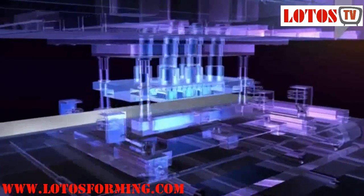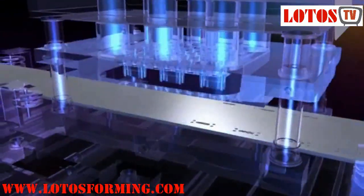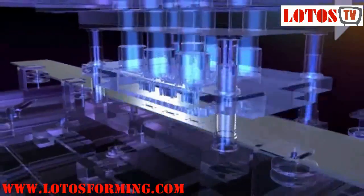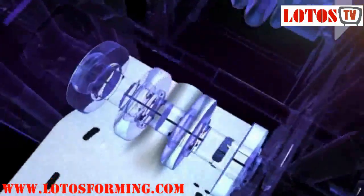Very precise, complex cross sections can be created, and long lengths of these sections can be consistently reproduced. Along each length, features such as holes, slots, or embosses can easily be added, making the roll forming process a very cost-effective method of achieving a strong, multifunctional shape.